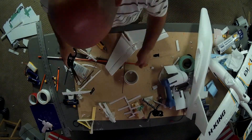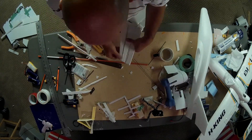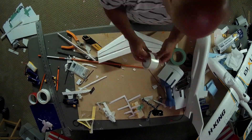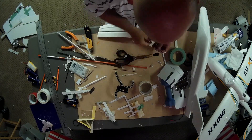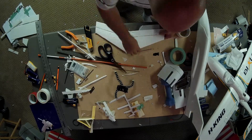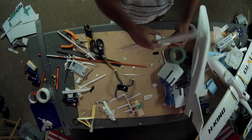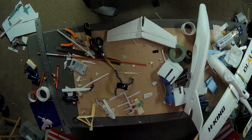Here I'm just using some thin pieces of carbon fiber — not the thick pieces, just very thin round pieces — and I tape them onto the bottom for some extra rigidity. If I were doing it again and had cut properly, I'd probably indent a little bit into the foam, lay the carbon fiber right into the foam, and then glue and tape over it.